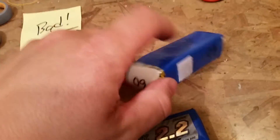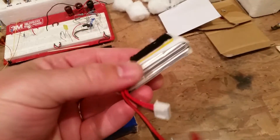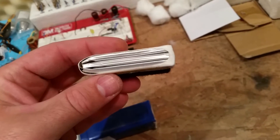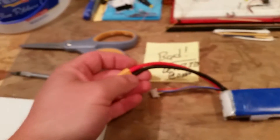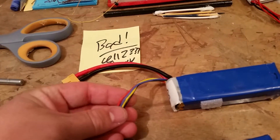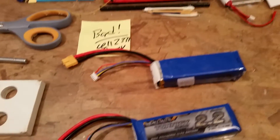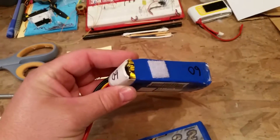We need to get to where the wires are landed across the three lithium polymer cells. This is a 3S and you can see the cells are a bit more exposed - it's an old 8C battery. LiPo packs are constructed by taping the cells together, putting the contacts in series. The two big leads go to your device and the balance leads go to the negative and positive of each respective cell. I'm going to get this opened up more and show you what we have.